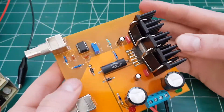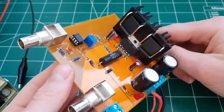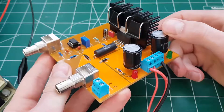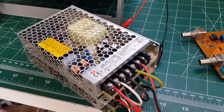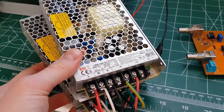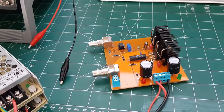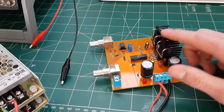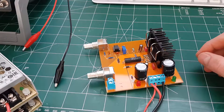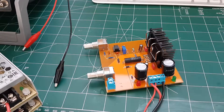I've got this little clip-on heat sink here. I think I might need to go a bit bigger because the way it is now, it gets stupid hot. It's driven by two 24-volt power supplies — 24 volts at about six and a half amps each, to give you plus and minus 24. These chips can take higher, up to maybe 36 or 40 volts or more. 48-volt supplies were too much, so I had to go with 24s.